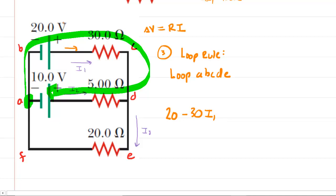We move through the 30-ohm resistor, continue clockwise, and go through the 5-ohm resistor. This time, looking at the direction of I2, we're moving against the current — moving left while the current moves right. Moving against the current is always a positive potential change, so we write +5I2. Then we encounter the next battery, moving from positive to negative terminal — that's a negative potential change: −10 volts.